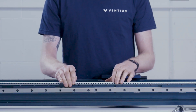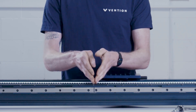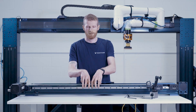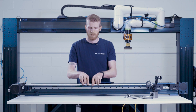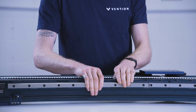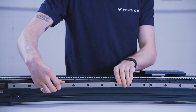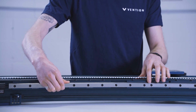The first step in doing this successfully is going to be ensuring that you have one of these rail supports with its center pretty much directly spread between the two rails. It's very important that each rail has two bolt holes — so you can see there are four in total here going through the support — and that will ensure that we get a good connection. Installing this butt joint is going to be very similar to installing a standard rail, except you're going to be applying some force from the end, or you can hold the rail from the middle, to ensure that the joint is closed and held together the entire time.